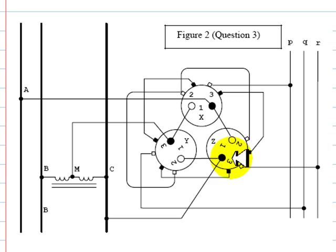The questions are: Part A — what is the connection group of this trio of transformers? Part B — connected as described, what are the voltages between P and Q, Q and R, and R and P, both in magnitude and in phase?